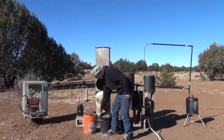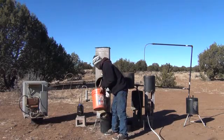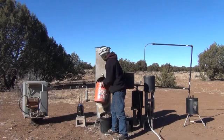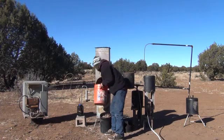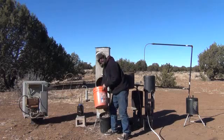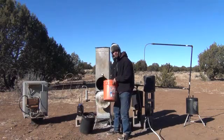Let me show you how I load the stove. When we have this much mass, it's actually easier to feed it into the top opening than the lower opening. So I'm just going to start throwing in material. You'll see just how much of this bucket I can actually fit in there, and how much fuel and energy is released by this stove for a small amount of wood. The production models actually have a 20, 30, or even 50 gallon reactor can, because this doesn't produce more than about 35-40 minutes of usable gas from 5 gallons.